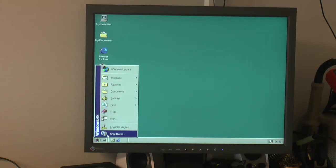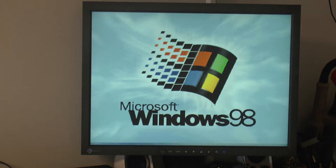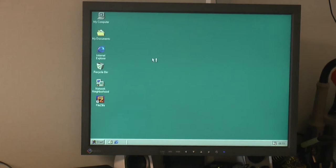So now I'm gonna try the Soundblaster 16. So the CT2800, the Soundblaster 16, is installed now. It's not really a plug and play card, so it needs the hardware wizard to work, so we shouldn't see it here on the ISA PNP stuff as far as I know. So it not showing up should be normal. So if we add the card with the wizard now, it should work.